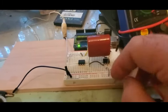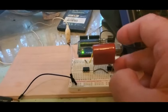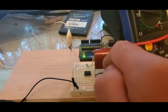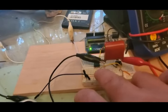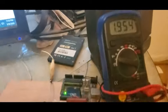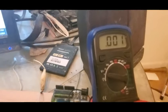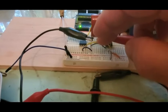Once these lines are broken, this is just a cap sitting on the breadboard. If we take this line, put it through a switch, and connect it to the other leg, the cap shorts itself. You can see now we've got the positive going out to one part of the switch and the other part goes to negative — it charges up, becomes isolated, and then discharges.